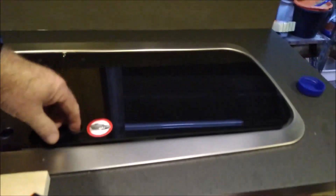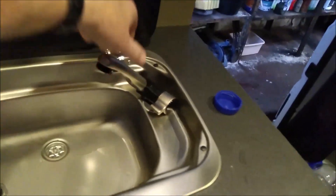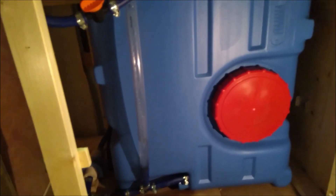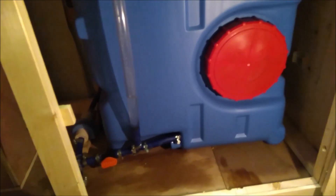Now what I'm most interested in is how much water is sucked out of this pipe when you operate the tap. There's the level — turn the tap on. Wow, that's quite good — it is going down slightly, but that's not bad at all. Let me turn it off. It won't come back to its original level immediately because the restriction stopping the water going out of the pipe also restricts it coming back in, but it will eventually after a few seconds go back to its level. Yeah, I'm quite pleased with that — I would say that was a result!